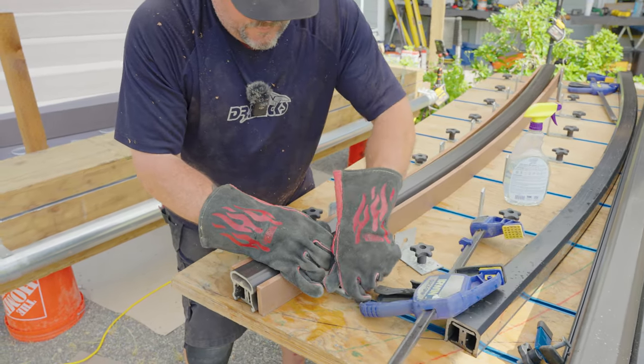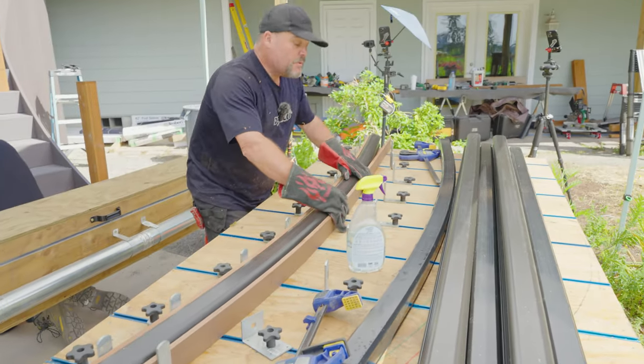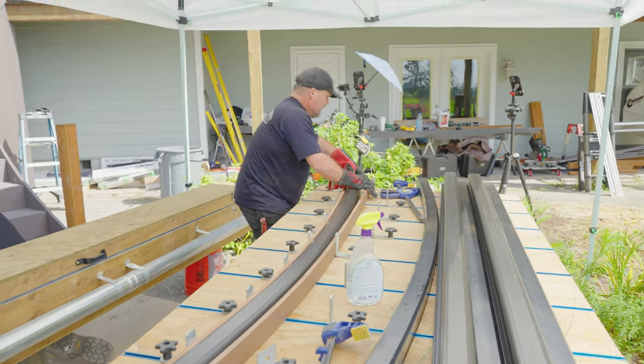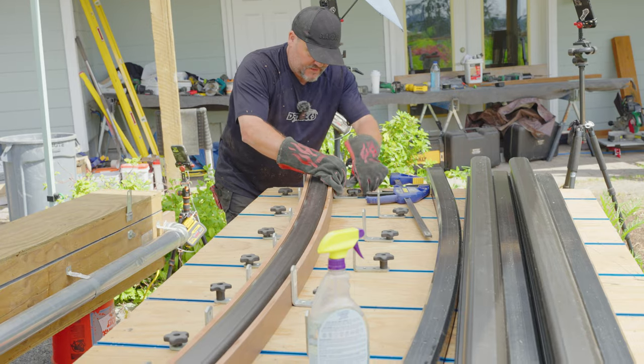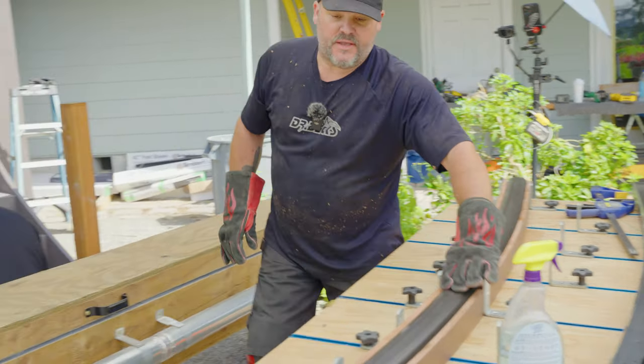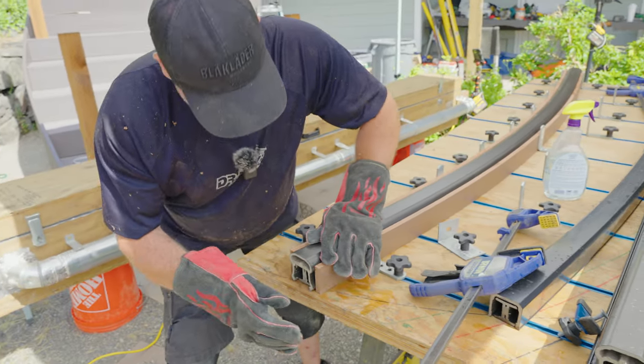Okay, so this stuff is heating up phenomenally. There's no blisters. It's bending the way it should. I did have to crank the heat a little bit on the blankets. And I use HeatCon silicone heating blankets, their heat forming kit, exclusively when I'm doing this.